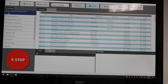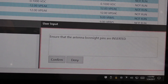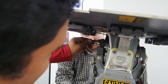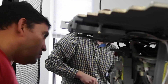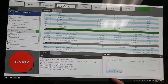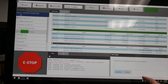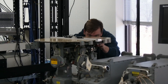Now that we are moving on to the actual running of the test, there are different requirements for different tests. Some of them require the antenna to be aligned with precision boresight pins, and then a difference is taken later on to know what the electronic-to-mechanical alignment actually is. Each one of these, in order to maintain safety — not just for the operator but also for the LRU itself — prompts and stops are put in at each sequence when changes in or out of the boresight pins are required.